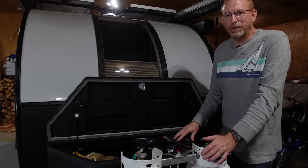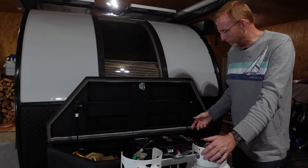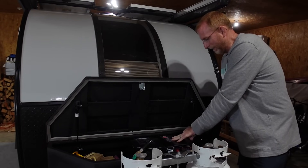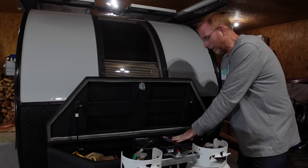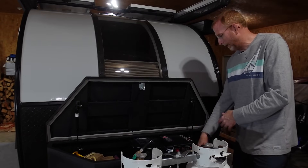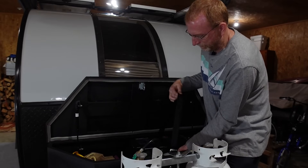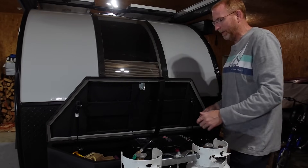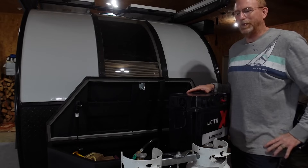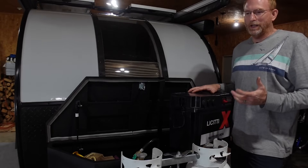At the end of the day, we've got standalone systems — drop this in and go. When we get back from camping, I make sure the switches are in the center off position, unplug three plugs: the AC plug from the charger, the black plug from the solar charge selection, and the power wire going to the selector switch. I undo the strap — takes about 10 seconds — lift the power station up and out, put it back in my truck, and go to work. No more batteries sitting in storage all year that I have to babysit.